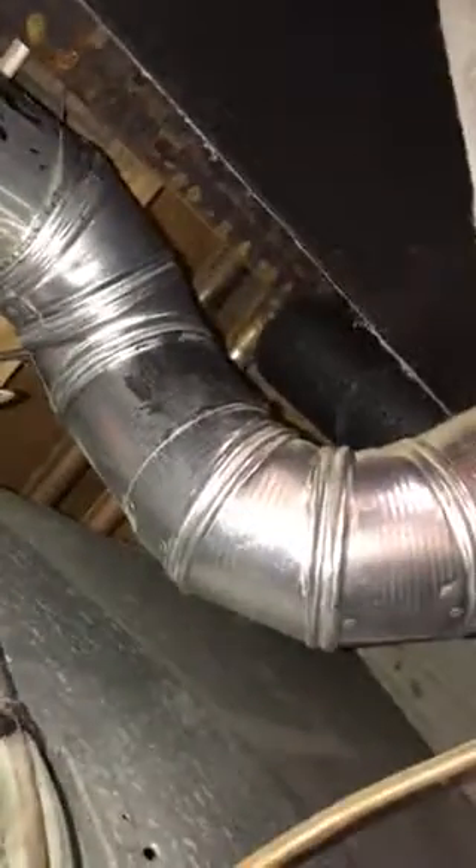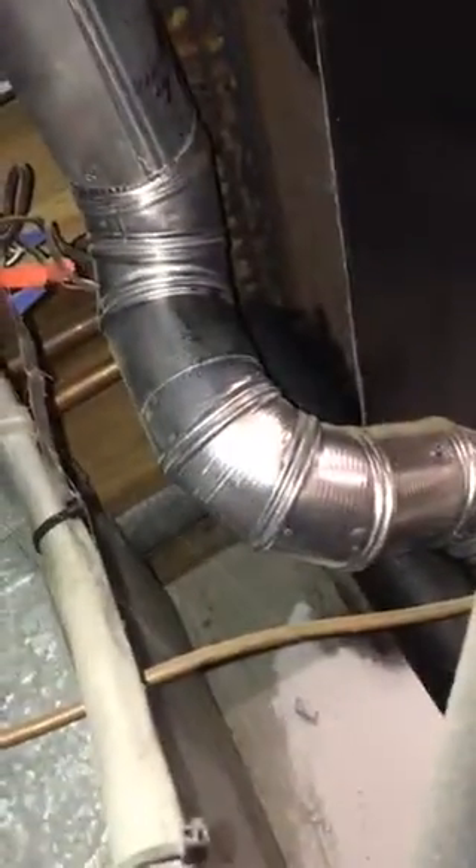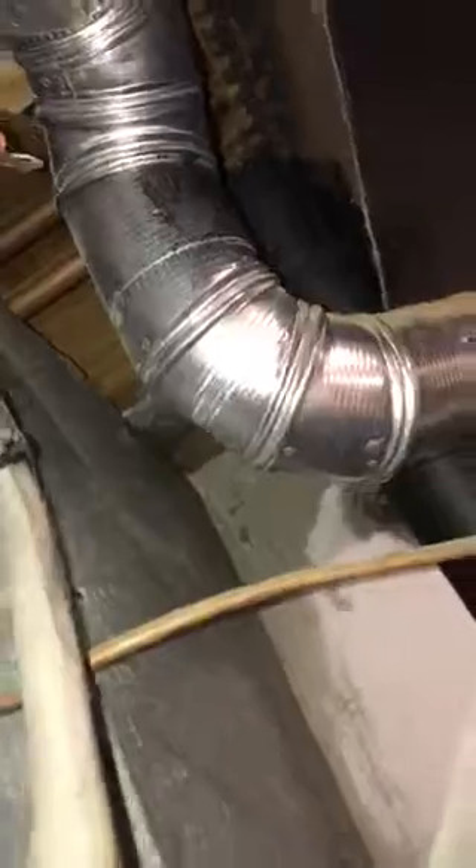If you could just cover that joist with metal, that reduces the clearance requirement to one inch, and then he would meet code. Also, some of this flue pipe is put together without any screws at all — like that one joint right here. But you guys will put it all back together right.